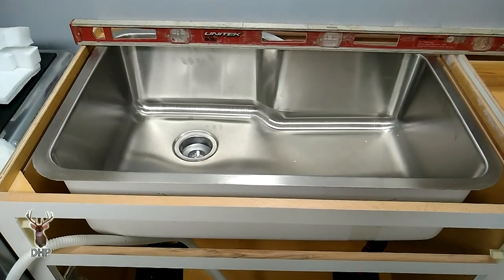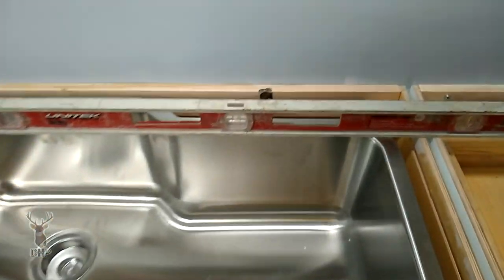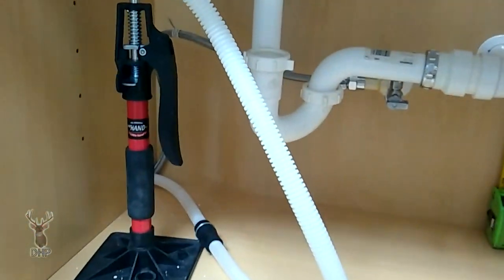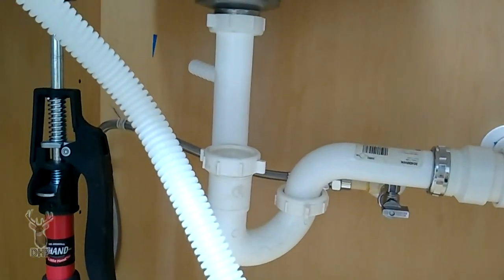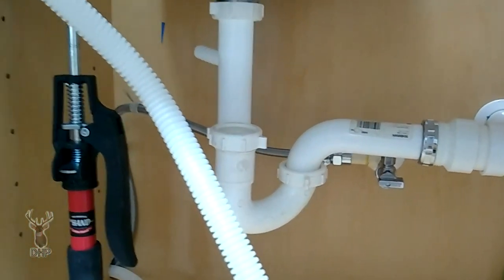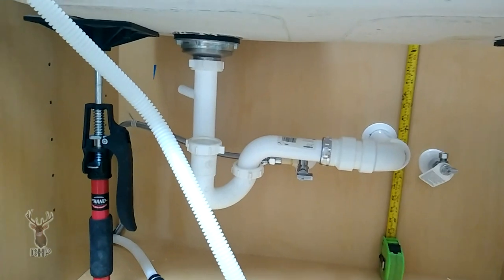We're nearly at the end of the video. We've got our sink set up with the wrapper off and a straight edge across the top. Let's go see where I stubbed this out. 17 inches. Now looking at the drain tailpiece, we've got two inches we could easily take away and drop this down. This happens to be a 10-inch sink — around seven or eight is about standard — so we're two inches deeper. We could go as deep as 12 inches. 12 inches plus 5 is 17 — and where did we stub this out? 17 inches. Someone planned ahead on that.